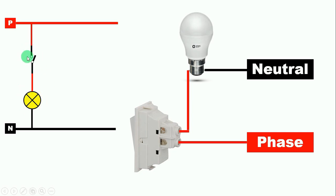I have used only one switch to start this bulb. Now if I tell you that to start this bulb I have to use two switches, and if I press any of the two switches then our bulb should glow — how should I do the connection? In the circuit diagram, we will connect one more switch in parallel to this switch. Power supply from here goes to both the switches. Now if I press this switch, the bulb will glow, and if I press the other switch, the bulb will also glow.